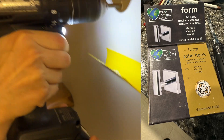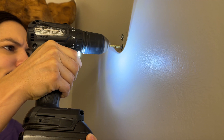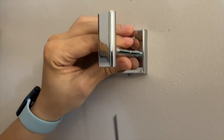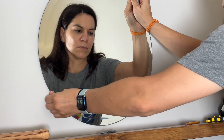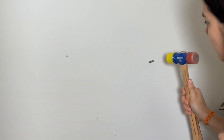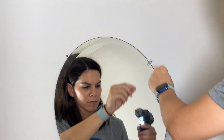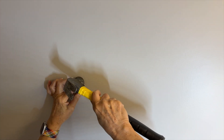Lastly we added some new hardware with a cool bubble look. We also added two hooks to hold various bathroom items that guests might need. These attach to the wall using molly bolts — you first tap them into place, then drive the screw which pops open the anchor and secures it to the drywall. Then I removed each screw and screwed in the mounting plate; the hook secures with a tiny Allen wrench. To enhance the lighting we added a circle mirror above the back shelves, using mirror hanging hardware with anchors and clips to secure it in place.